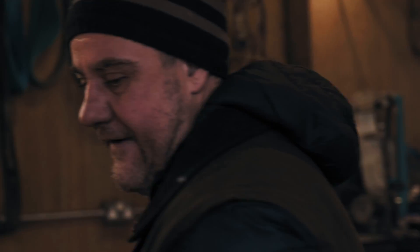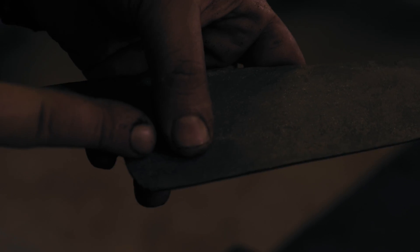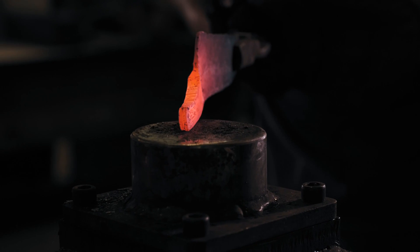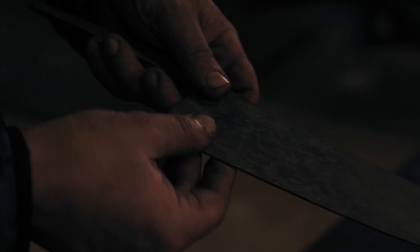This one is insanely good. The only problem is it's still nice and thick there — there's a limit because it's a low bevel, and we're going to start touching the spine as it's so thick up there. We're going to have to keep that bevel super low on this one because it's such extreme geometry. It was a bit unintentional — I intended that to be a lot thicker there because I used a lot of metal for this one, and it's just rather large in its proportions.